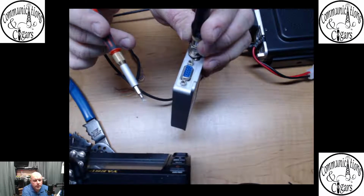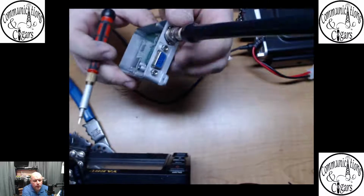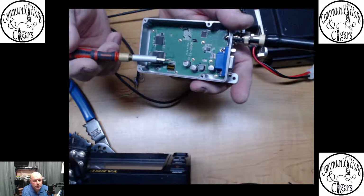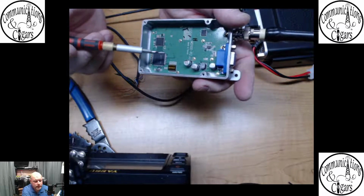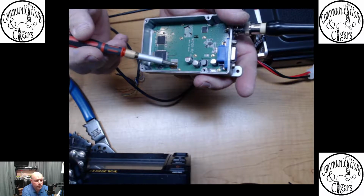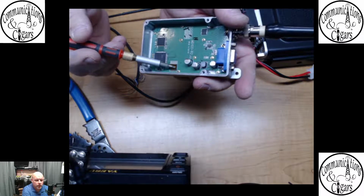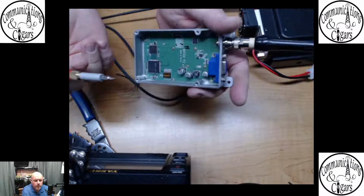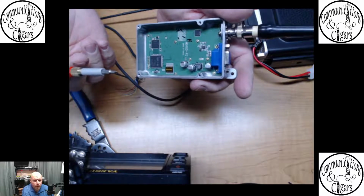And if you wanted to, if you have a certain frequency you like, or a certain repeater you monitor, analog or digital, because this will do FM with CTCSS and DCS. If you want to change channels, you're going to have to flip these little dip switches here. But for the most part, 10 watts, I can get pretty far for 10 watts.